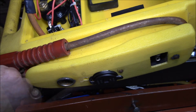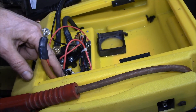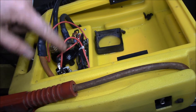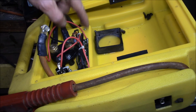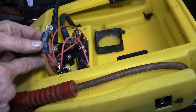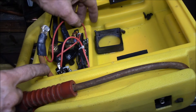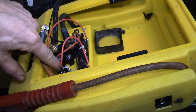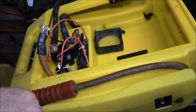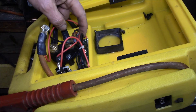I'll put the USB in there, but first I need to get the switch in. As far as wiring, the back of the voltmeter has three spade terminals - one goes to the 12 volt outlet, and another runs over to the circuit board tied into the positive lead. They have the heavy jump start lead and a little auxiliary power, with red and black connections, so I can hook up power to the USB. I'm going to run the switch on the ground side and probably solder it onto the circuit board.